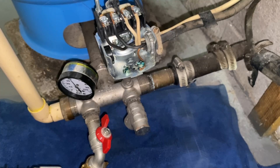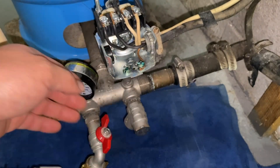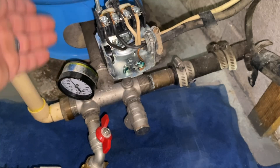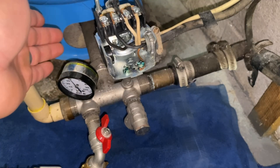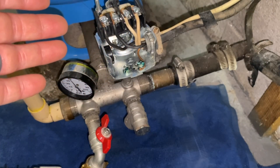For example, if you pump this up to 80 PSI the pressure relief valve goes off — it will just drip until you get to 75 PSI and then it will stop, until the pump turns back on and drips again. If you have water sitting around your basement you run the risk of mold and all sorts of other contaminants. With systems like this it's very important to be conscious of all the decisions you make. The standard conventional practice is 40/60 PSI — not because we don't want you to have good pressure, but because we don't want you to hurt things in your home that you may not think about.